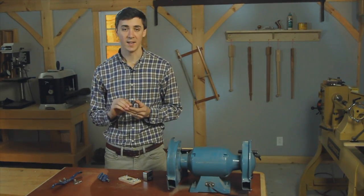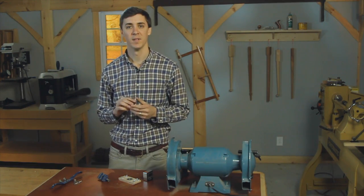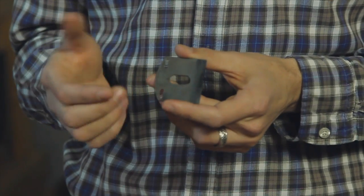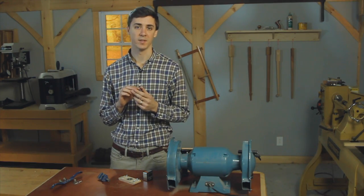Sharpening begins with flattening the back of the blade. If the back isn't flat, Gochner recommends lapping it and working your way up from 220 grit sandpaper all the way up to 2000. Once the back is flat and polished, you can move on to the grinding phase.